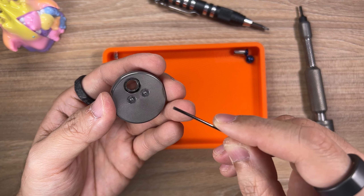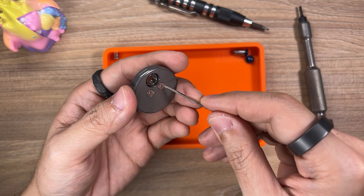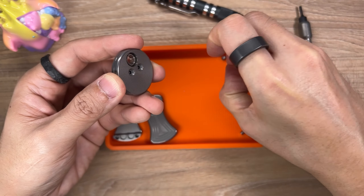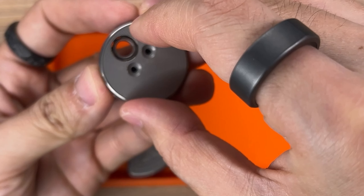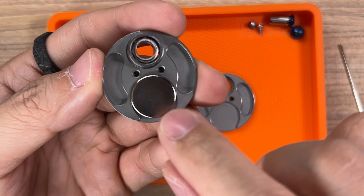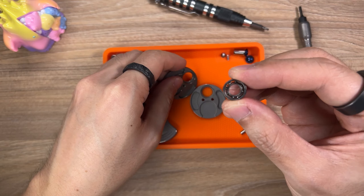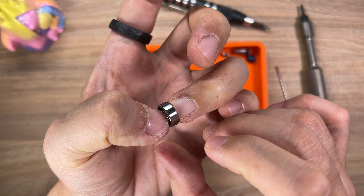These are held in via the magnets as well as the stopper pins — these stopper pins go into these slots and they will sit just like that. Now we're going to take a look at the main spinning disc area, and on this side it is really clean — no other slots besides this particular cutout for the R188 bearing. This is a steel cage R188 bearing. If you flip it over you'll see that is where the two hex screws reside, holding these two halves together. So you're going to get your hex driver and you'll see it starting to get attracted to the middle because of the magnet in there — so just be careful when you're doing that.